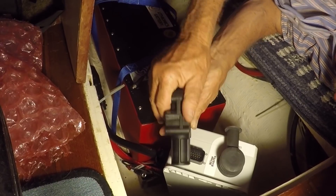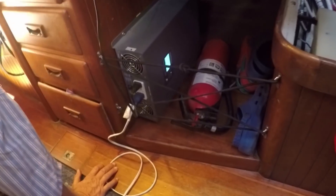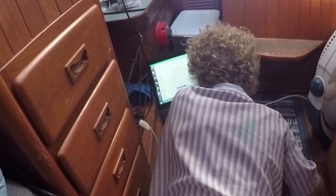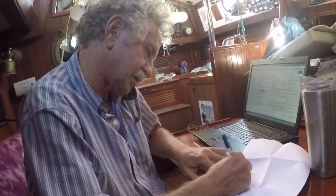The BMS was actually larger than I expected, and the four-aught connecting cables were hard to maneuver. I eventually got everything wired, but configuring the Xantrex to charge the battery was not as straightforward as I had hoped. It turns out that while the Xantrex can charge the battery, our model requires a firmware upgrade that will have to be done in the States. Upon connecting our solar controller, I discovered it didn't have the capability to be configured to the specifications of the battery's manufacturer, Lithionics.